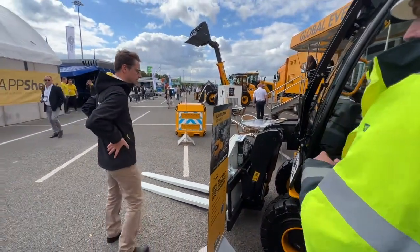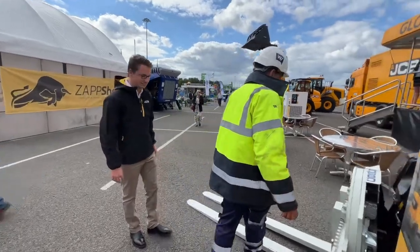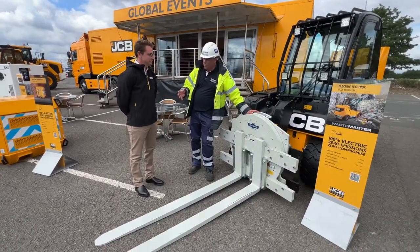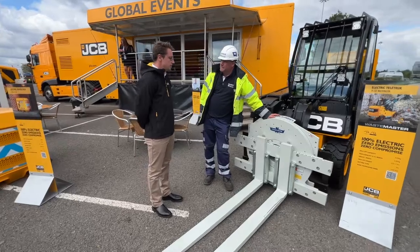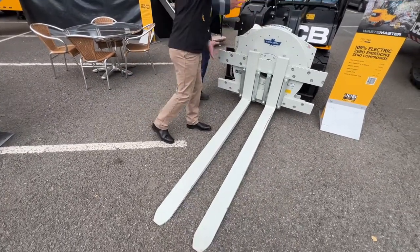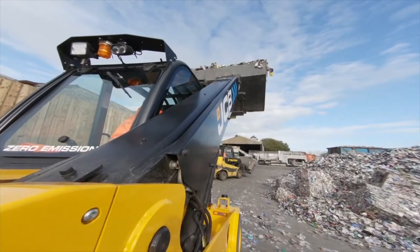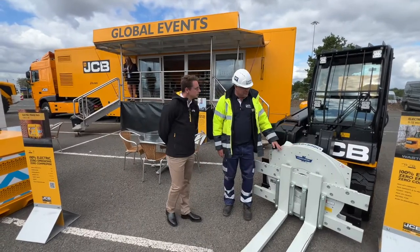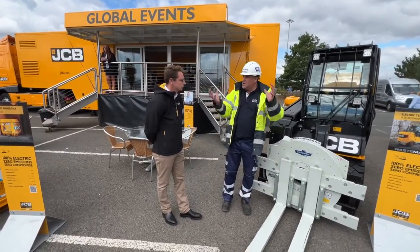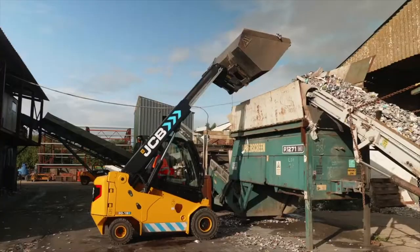Let's get to the business end - unlike a little forklift, this has a hefty set of forks on the front. These are 1800 millimetre Bolzoni Cascade rotator forks, and this also rotates. So if you have buckets on the front for metal recycling you can tip them, or at ELV points you can tip cars when you need to move them. Fundamentally, you need that sturdy counterweight - which is the battery - to handle the movement.